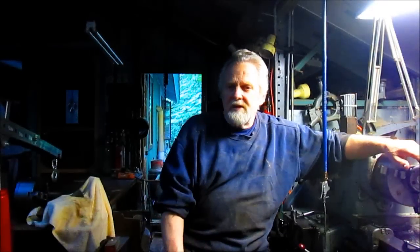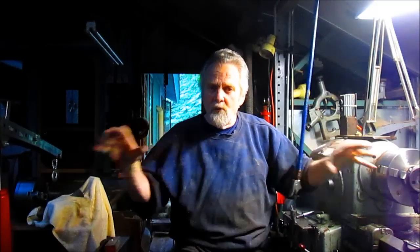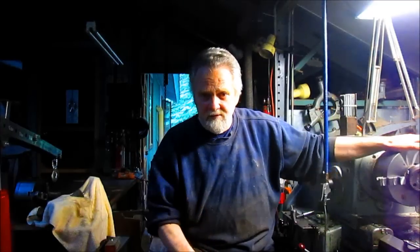Good morning, Nick Collier here. Coming up is a really interesting little project. We're basically going to take some six-or-so inch angle iron by probably a half-inch wall. We're going to cut that up and form it into four V-blocks and a notcher — and no, we're not making chips and cheese. We are making the ability for my customer to drill a hole in a piece of pipe at an angle — accurately at 30 degrees and at 45 degrees.